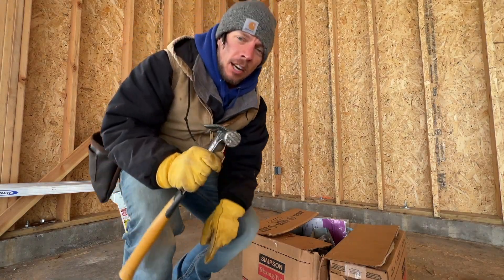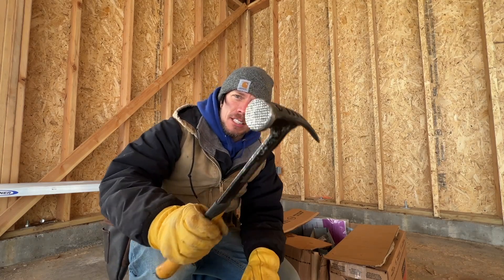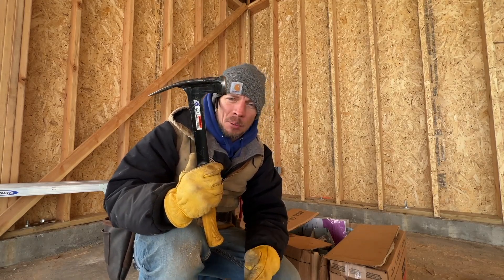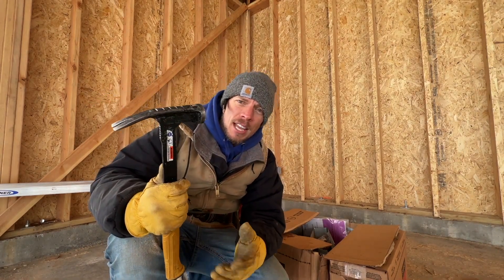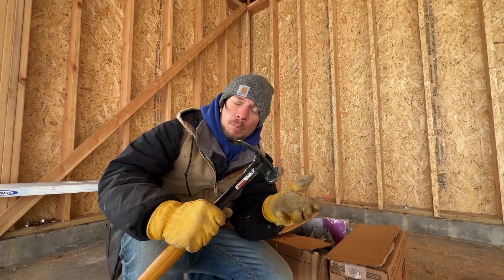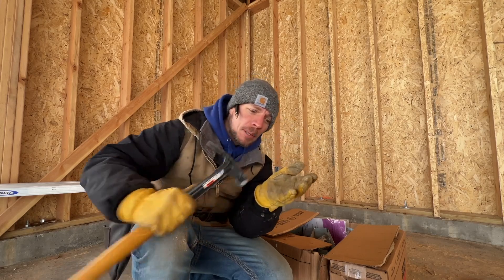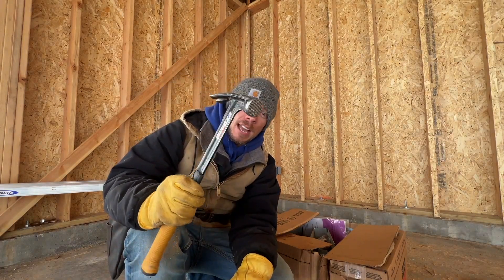If you're using an old hand-me-down hammer — which is great, I love not spending a fortune on tools — a better tool does make a job go a lot easier. This is a framing hammer; I'll link it in the description. I like it because it's light, it's steel so it won't break, and the waffle face head allows me to hit nails without slipping off. A lot of bent nails come from the hammer hitting wrong — the waffle face provides traction so it doesn't slip. Once you use a hammer like this, you won't want anything else.